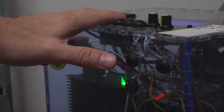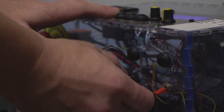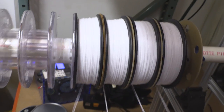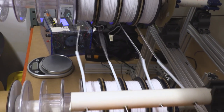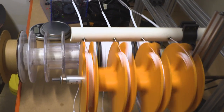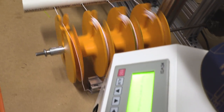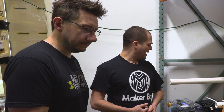Once they're all loaded and secure, you're going to push this button. This Arduino-controlled device tells us how many spins, and based on the number of spins we know the length — we can change that, do a little more or less, and also turn the speed up and down. It's 37 spins for 1.75 millimeters, which equals about 16 meters. For 3 millimeters it's about 14 spins, which is about 6 meters. That's roughly equal to 50 grams of PLA.